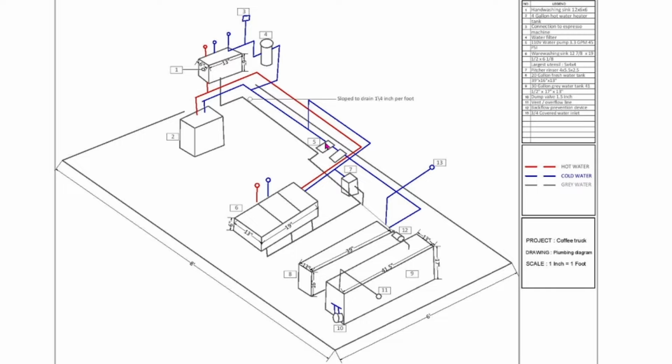And then I think it's also another good idea to have another shutoff valve right there, just in case you need to switch your pump out. The system of the truck is very reliant upon the pump, and your workflow is very reliant upon your pump. If you plan on doing big festivals, then consider being able to switch your pump out in the event you run into pump failure, because otherwise it just leaves you like a sitting duck.